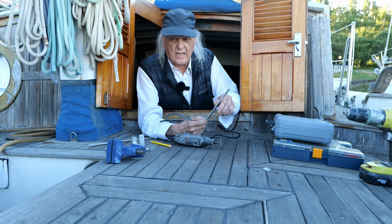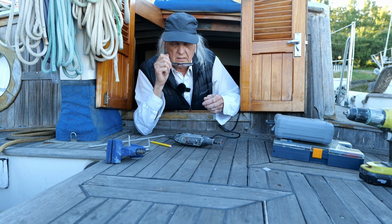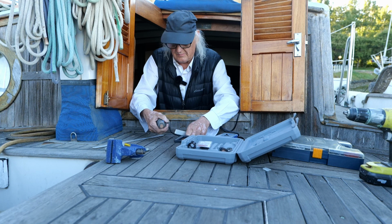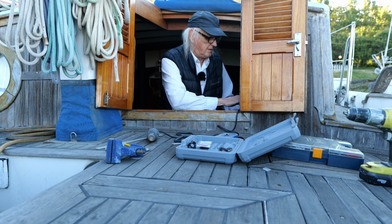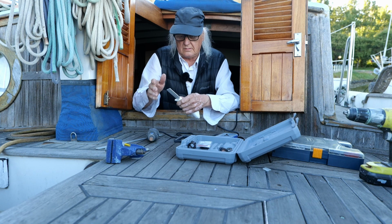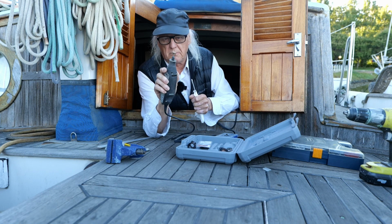Now I just got to cut off this other end and round it a little bit because I rounded these slightly, so I'll have to use another bit. But I'm going to go ahead and cut this one, and hopefully I don't have a problem like I did. This is getting hot, it's hard to hold on to, so I'm just gonna grab the paper towel. Okay, now you see my grinding wheel's already getting aluminum embedded in it.